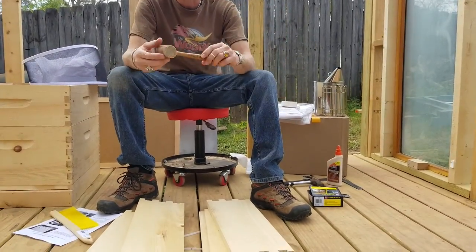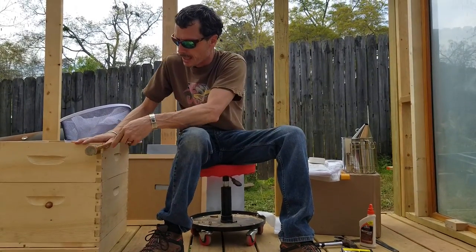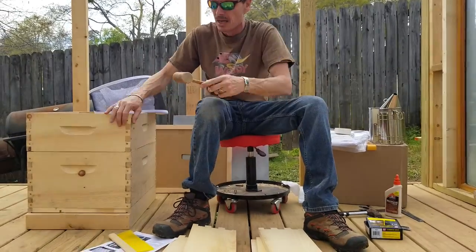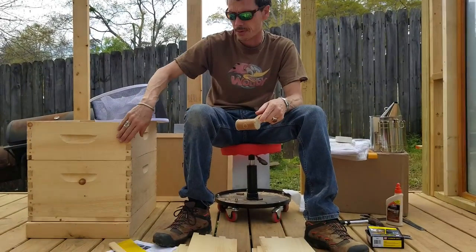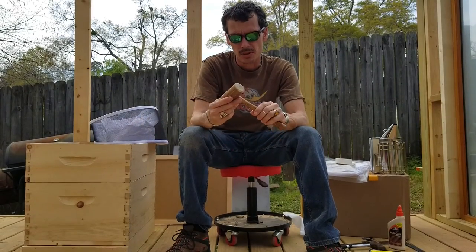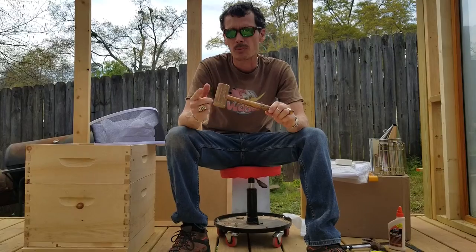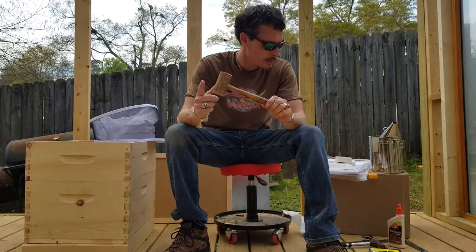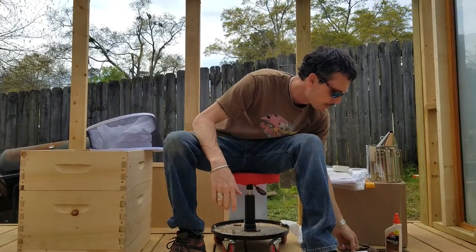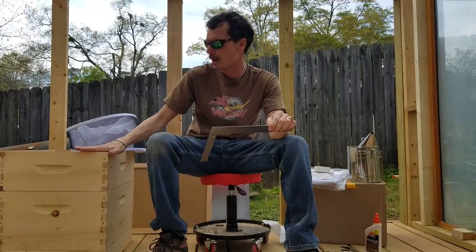Also, it does not state this, but I really, really like the rawhide mallet. It works great. I can go in and hammer and tweak the edges with this and really not mar up the wood a whole lot. So once we get to sanding and painting, it'll save us a lot of headache if we just use this to tap it all and get it lined together. I highly recommend a rubber mallet, rawhide, plastic — something besides metal. And of course, they also say keep the frame square, so make sure everything stays square and true for your boxes.